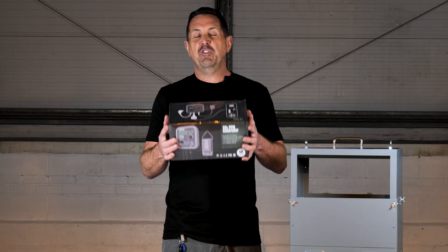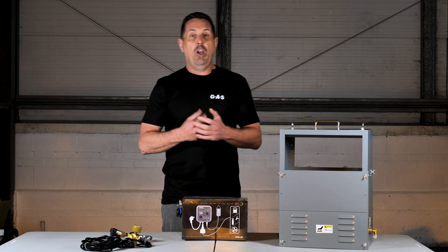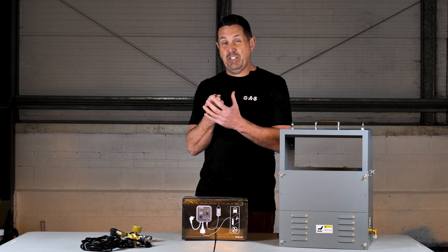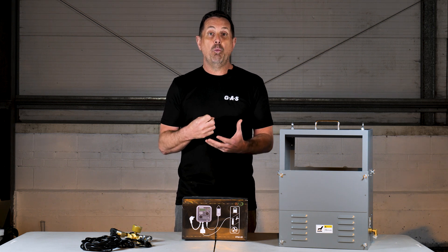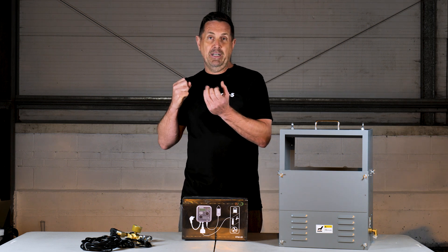It's got a feature called Fuzzy Logic inside it. When you're running CO2, the CO2 bottle can be really cold — the gas can be compressed and very cold into the valve — and what it can do is freeze the valve up and basically stop working. So what the Fuzzy Logic does is inject CO2 into the room and then stop, inject and stop. These short bursts of CO2 prevent the valve from freezing up.